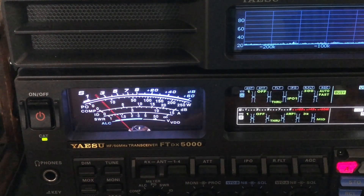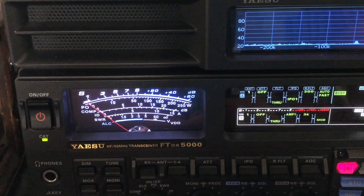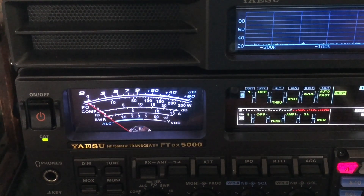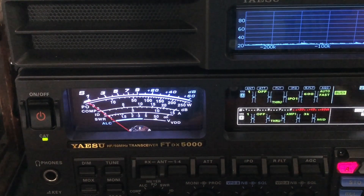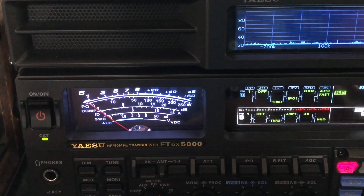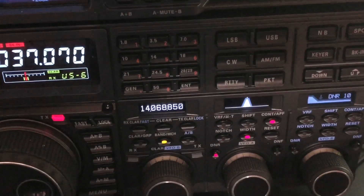That's a strong one. Let's see if we can find something a little weaker. There we go — not moving the meter, so no help. I don't like to hear all that. I'll do it in reverse order: digital noise reduction 15, audio peak filter, and then digital filter width — I'm at 100, I could go down to 50. Let me move the camera back over here to the DSP area so you can see what I've got set up here.